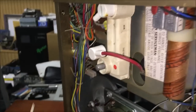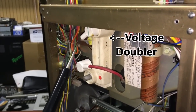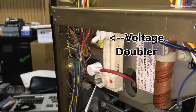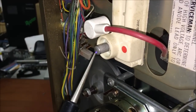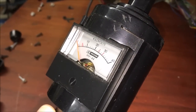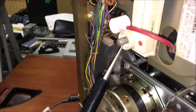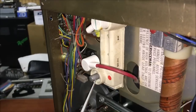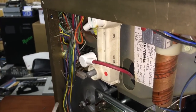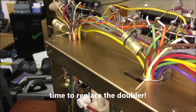The old voltage doubler is still installed so we can check the voltage output from that and see if it gives us anything. The voltage doubler is that white block there. High voltage is coming in from the transformer into the doubler and then out here - as I get close to this it should draw a nice little arc. We're still reading just over a thousand volts, not the twenty thousand I believe we're supposed to be getting. Houston, we still have a problem.